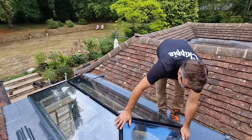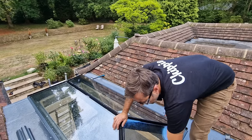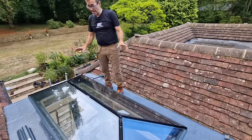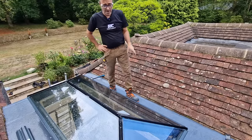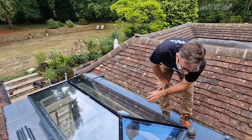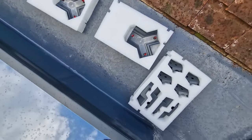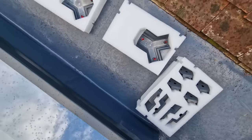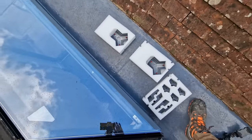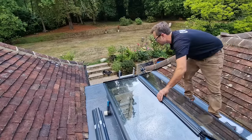All I have to do now is get the last of the parts out, which involves some friction fit dowels that hold a cap on, and then we've got some nice cover fillets — a really straightforward job. Check this out: this is how the parts are actually packaged — so well packaged, so well looked after. So it's just a matter of putting all the sections in. This is the ridge cap — it's a tap fit. Get it equidistant, check down along its length, keep this section the same distance off both ends, and it's not going to take a lot to push it on. Check the gaskets are all perfectly in position and you can click it on. Once it's on you can tap it left and right with a mallet, but it's nice to get it right first time.